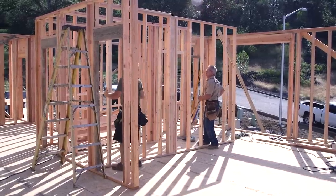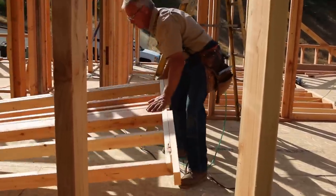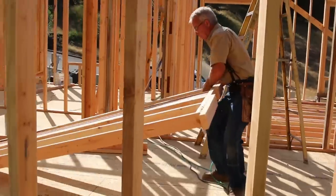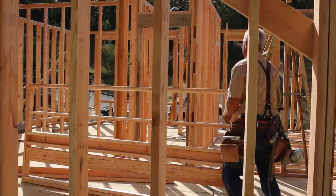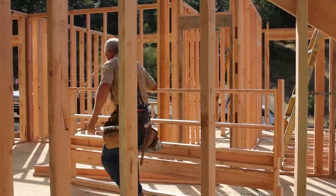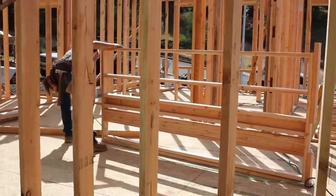The diagonal braces that you see stretching across the longer walls are there to give some temporary shear strength while the floor is being put on and while the wall sheathing goes on. And yes, there's a reason that I stood up the exterior walls without sheathing them first while they were on the ground, and I'll talk about that a little later on.